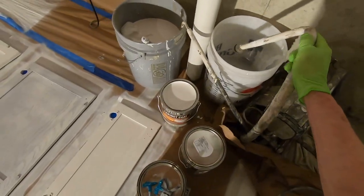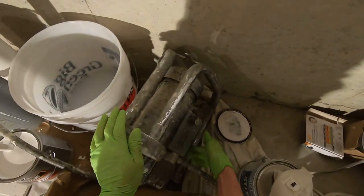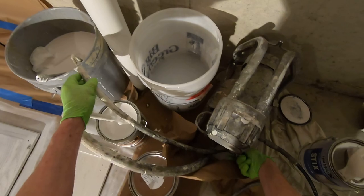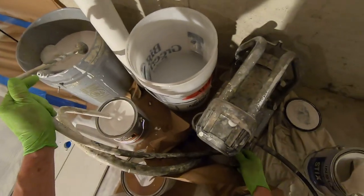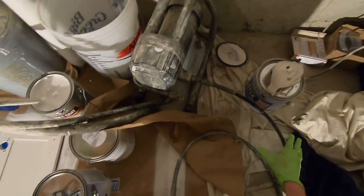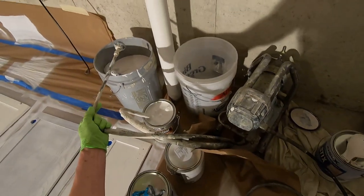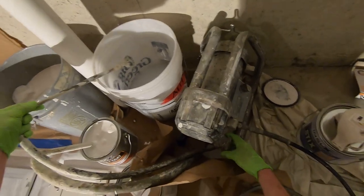This is our cabinet coat that we're going to use on our doors and our cabinets. So we put the pickup tube into the paint. We turn the sprayer on. Now what we're doing is priming. There's some water in the pump and also water in the hose. This is the prime valve. We can pour our pressure back a little bit. This tube is going to circulate just through into the pump.